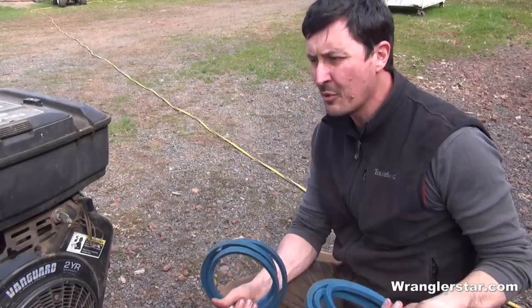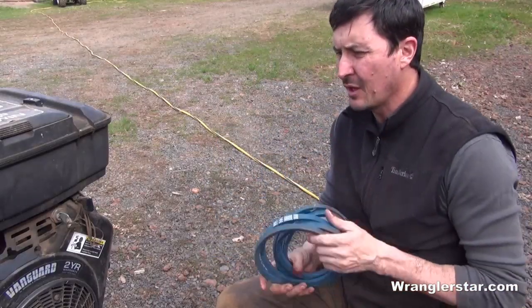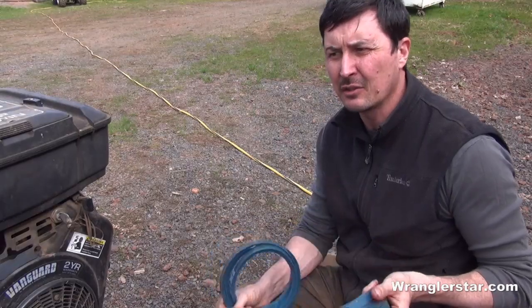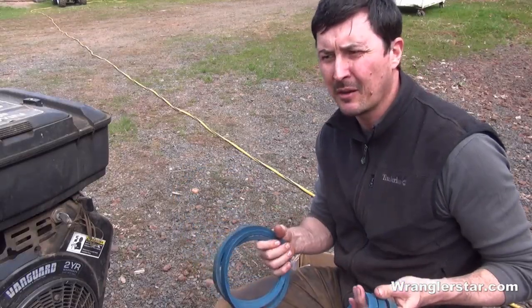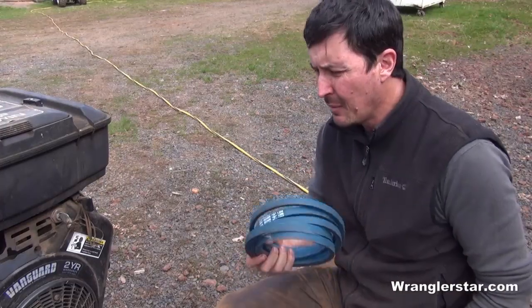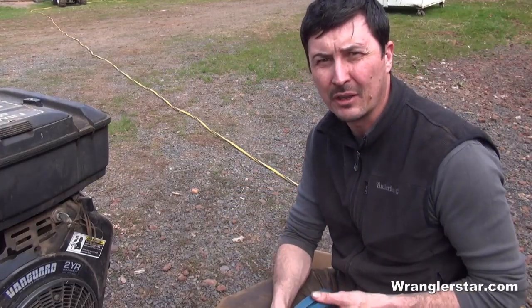There is one thing you need to look at on most equipment — whether it's a mower, a wood chipper, or a lot of other equipment — they have belts. If I was a professional using this to make my living, I'd probably change these things annually so I didn't have to suffer a breakdown and lose work. For me personally, I'm not going to change a belt that's working good, but I will have a couple on hand just in case so my whole day isn't shot if a belt shreds or breaks.